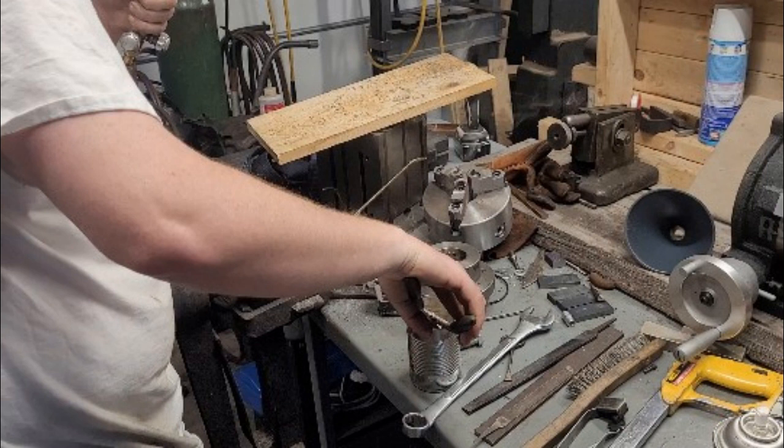This is the end of part two — we got the cutter hardened. Just an explanation: I like to have the oxy-acetylene torch running very rich for this because I get a softer heat with the brazing tip. I only have cutting tips, which don't work as well. The softer flame spreads the heat, so you don't get as many hot spots and you reduce warping. Right after this, the cutter went in the kitchen toaster oven for tempering — which doesn't go over well with roommates, but they will survive. In the next couple of days I should have part three live, so thanks for watching.